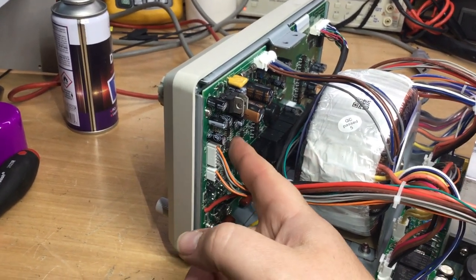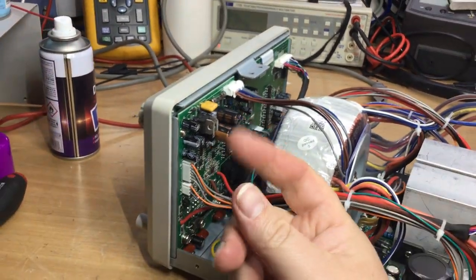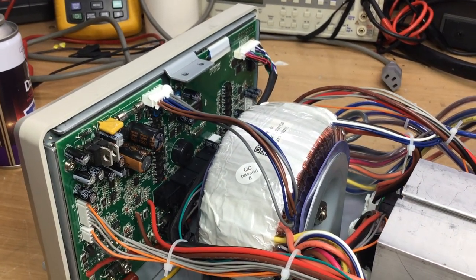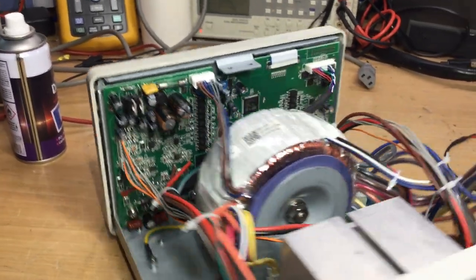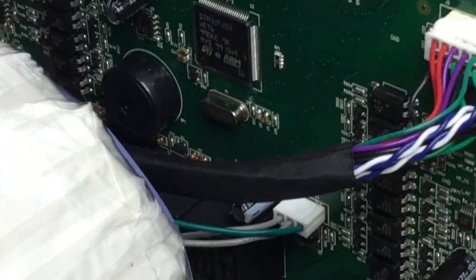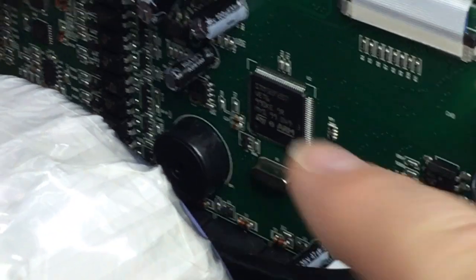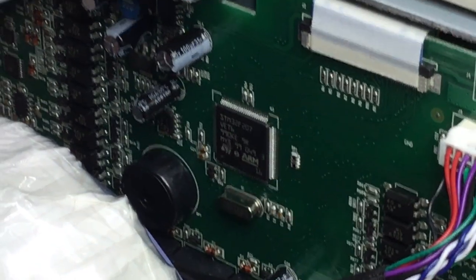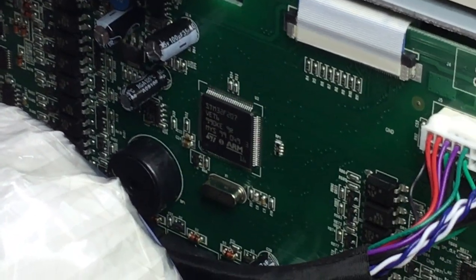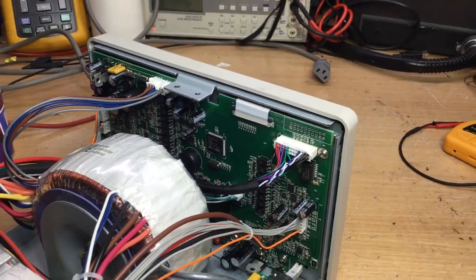But anyway, when you touch things like the microprocessor leads, the actual leads on the microprocessor, the resistance of your finger could cause it to shut down, because you could suppress the clock crystal signal that comes from the little crystal that's mounted on the board, which you can see just below the microcontroller chip, which is this silver can there, that crystal. So by physically touching these leads with the skin of your finger, you could cause the microprocessor to stop running, crash or fail. So that would be a false failure if you did that. So that's just a little rundown about that and how it works.